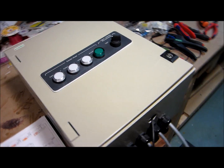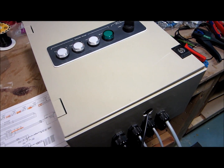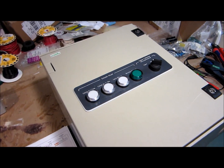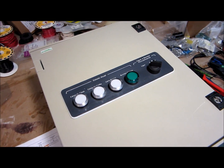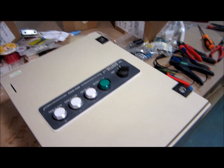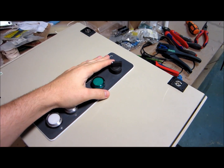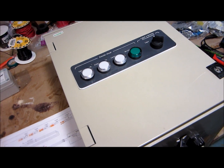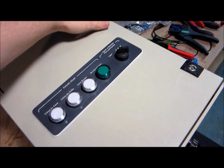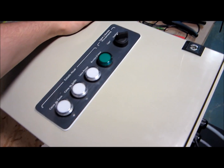Basically what I've got here is a nice fiberglass exterior enclosure. In front of this box I've got some pilot lights indicating the conditions or the status of each input and output, as well as a manual override switch should the pump need to be turned on manually. The water solenoids can be activated just by twisting their heads and going on manually as well, just as an added feature.